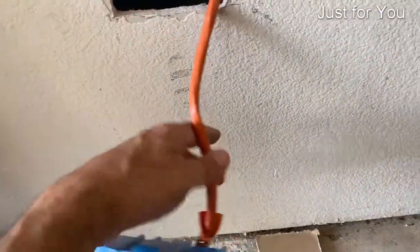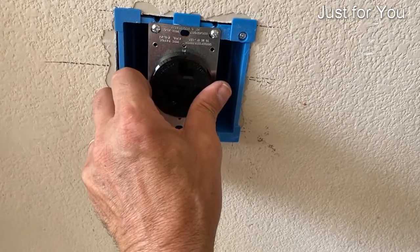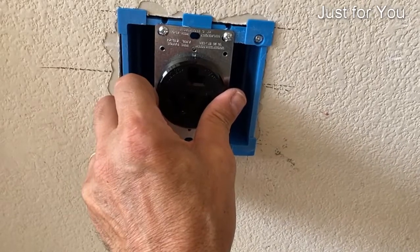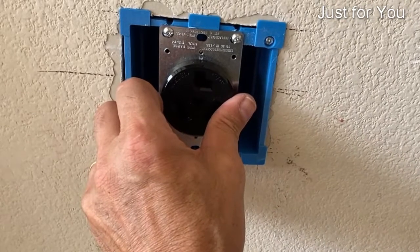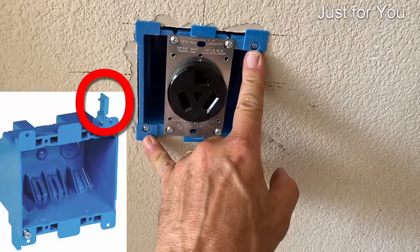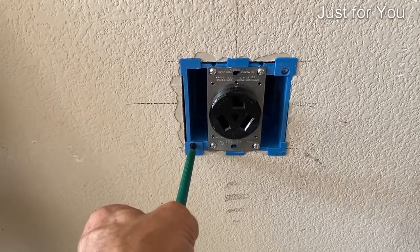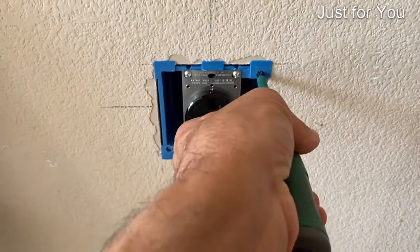The outlet is wired and assembled to the box. Now we push this back into the wall. That's a pretty stiff wire. Aren't you glad you wired that outlet first and mounted it into the J-Box first? Mount this onto the wall. Next, we tighten this screw to bring those flaps over so they can grab onto the back of the drywall. Tighten this one up and this one a few turns — and that's the last turn right there. Done.